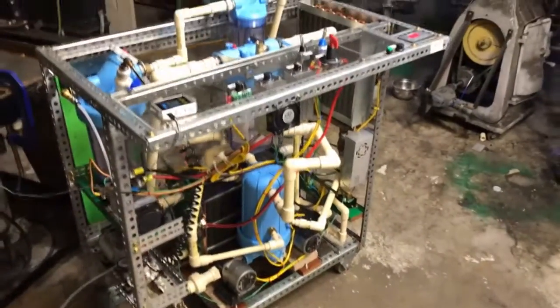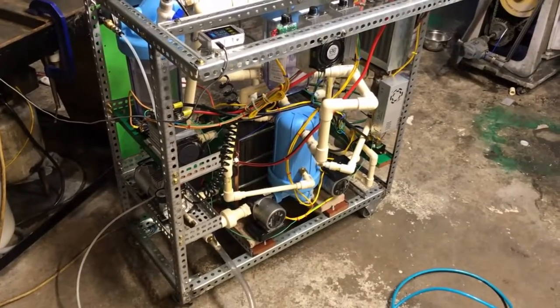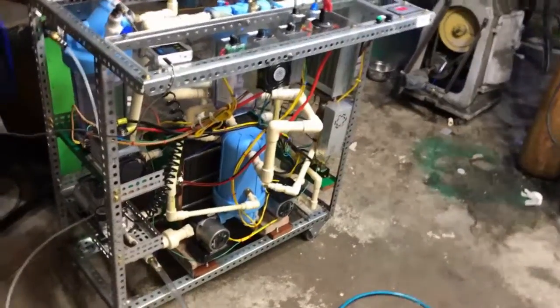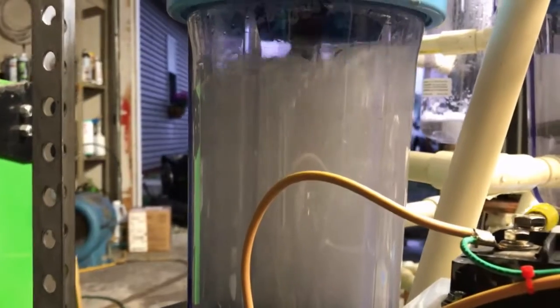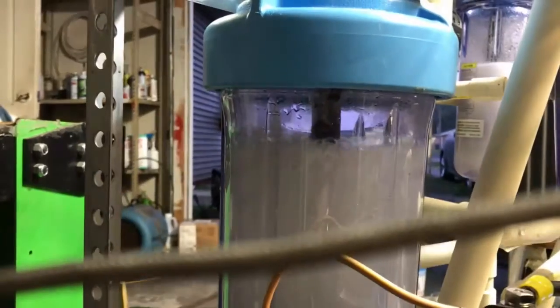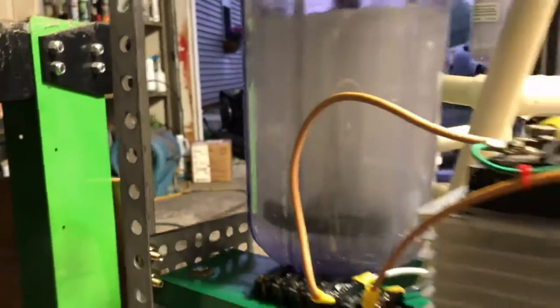When you're using this much power, you have to have a continuous input of water, or at least a cycle. Because if you don't, the electrolyte ratio will increase and the amperage just goes up. I overdid it, but still insane production though — pretty insane.